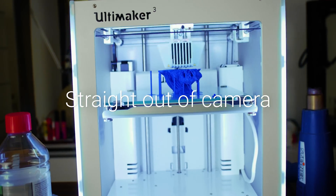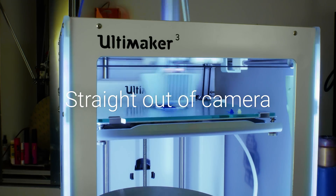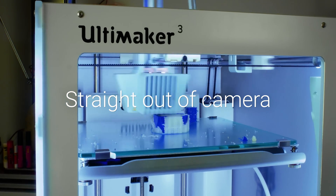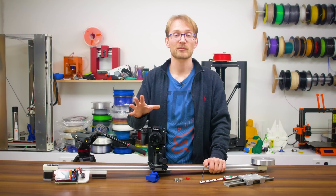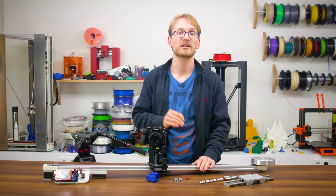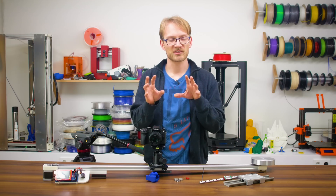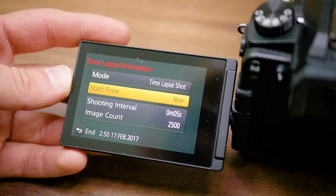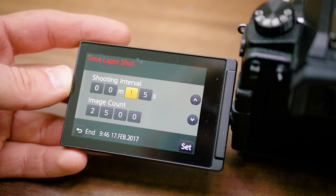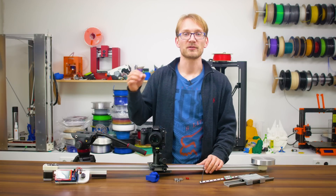Here's what that's going to look like. Don't forget to plug the slider into a power supply, as even the larger NPF batteries will only last for about half a day. A few tips on camera setup for the resulting timelapse to look great: you should have it as manual as possible — manual exposure, focus, and white balance — as cameras will have a tendency to jump around with their settings between shots. Using a longer exposure gets that dreamy, motion-blurred effect if you're filming something that moves, while a shorter exposure makes it crisper but might look a bit stuttery in the finished video. Most cameras have an interval mode built-in; use that to have it take pictures with consistent timing, or alternatively plug in an external intervalometer. Most cameras allow you to create a video file straight from the timelapse images, but you can always bring them into your video editor of choice.